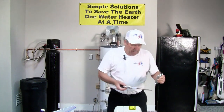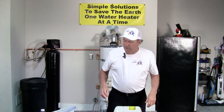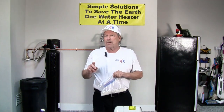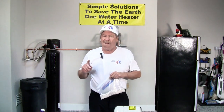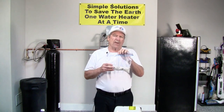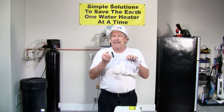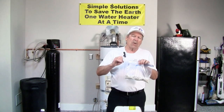If you're on hard water, hard water produces scale. You want to flush that water heater and you want a good flushing valve to do that with, because the scale, especially on a gas heater, sitting at the bottom of that water heater is a barrier between the gas flame and the water you're heating. It super-heats that bottom, that glass lining can melt, and that exposes the steel even more and causes the anode to work even harder.